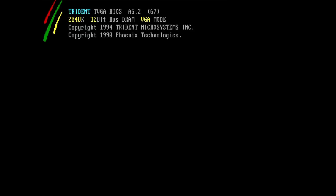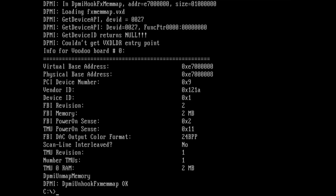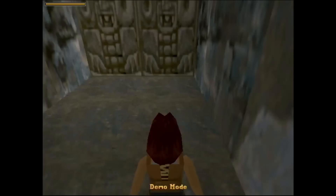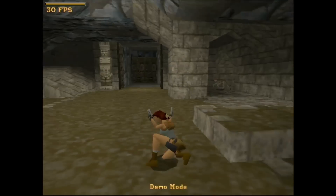There is no need to wait any longer. The card is back in the test system and the first thing I want to try is the Mojo debugging tool in DOS — we only got blank screens before. We get an output! The card returns some details. Although it looks like we have some missing information at the top, the information for the Voodoo board is complete — listed are the FBI and one TMU chip with 2MB of memory each. Could it be that this Diamond Monster 3D works now? Let's find out with Tomb Raider in DOS, which doesn't require any Windows drivers. If the game starts in 3dfx mode, then we can be certain this card is finally working. And we have a 3dfx logo — what an amazing turn of events. I almost gave up on this card. We are running in Glide mode because we were greeted with the 3dfx logo and we can see the frame counter in the top left corner.